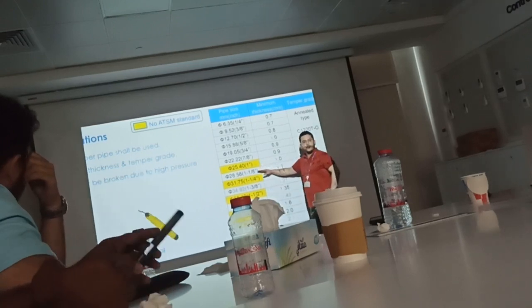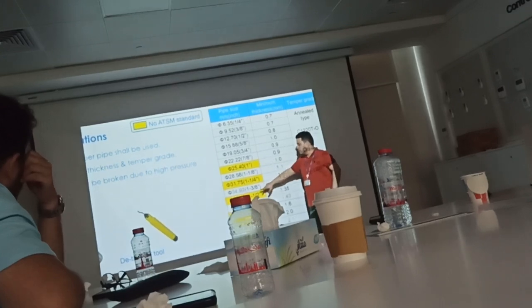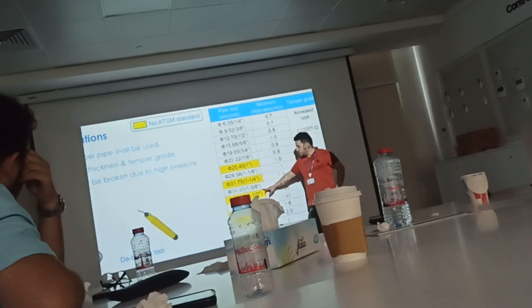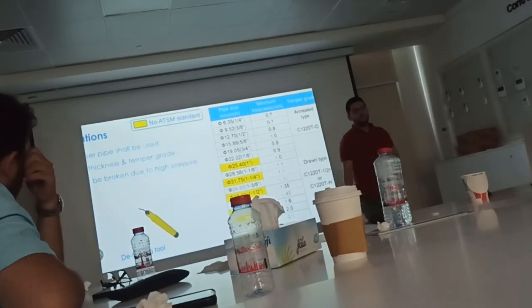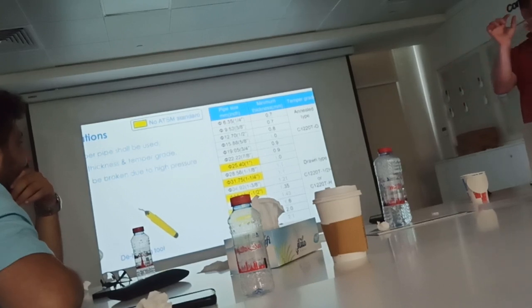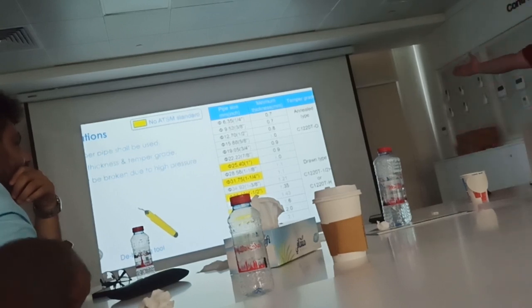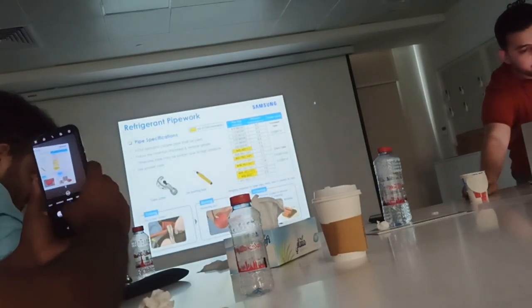What do I do? You always need to fix one size bigger. If you have 1 inch, use 1 1/8. If you see 1 1/4, it means you can fix 1 3/8. This way only. If you have 1 1/2, use 1 5/8. Understand? Why do we highlight this? Because in the schematic diagram, the contractor is always asking why we don't have this size. Because the system is generated, it calculates based on calculator software, so it will not know what is available in the market. It will show 1 1/4 or 1 inch, and you will know that you choose the bigger size.